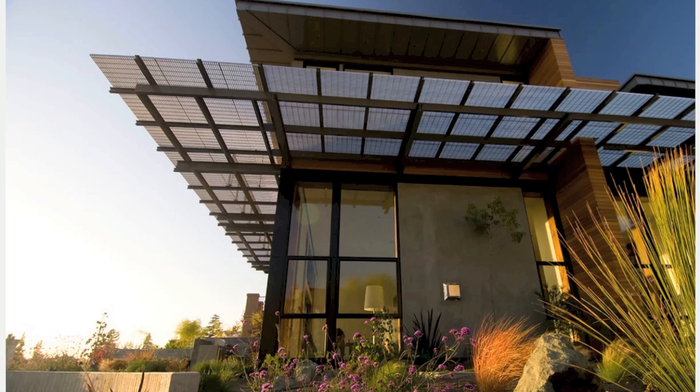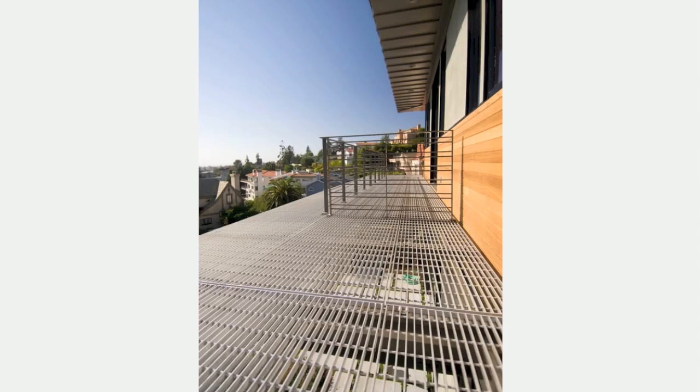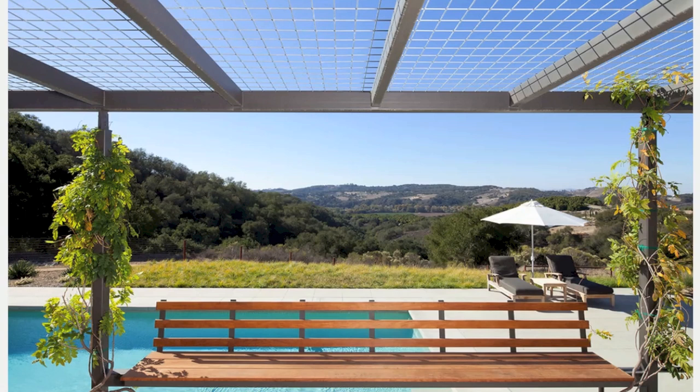Taller bar heights and closer spacing make for controlled shading with a sharp cutoff, while shorter and more open spacing provides more of a dappled effect. This project's two-and-a-half-meter overhang ensures that the lower glazed area receives plenty of filtered light. On the upper level, it doubles as an exterior deck in select locations and a catwalk for building maintenance. For large cantilevers like this one, lightweight aluminum is a good choice. If the visual weight of bar grating and perforated metals is too heavy, you may consider a wire mesh product such as this one. Wire mesh comes in a variety of configurations — from crimped for stability, to woven which is loose like fabric, to welded which is more rigid. The most cost-effective for an overhead trellis are made using repurposed or commonly available welded wire fabric, typically used to reinforce concrete slabs. With the proper structure, it can support vegetation and subtly define a seating area.